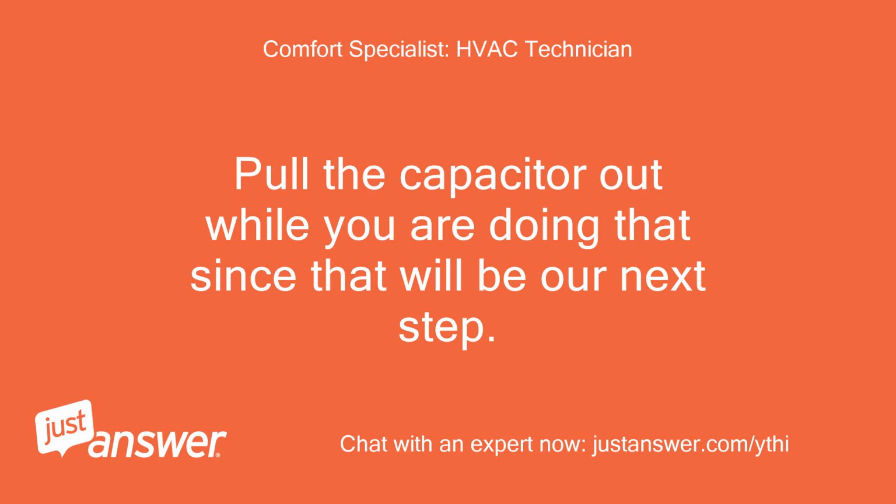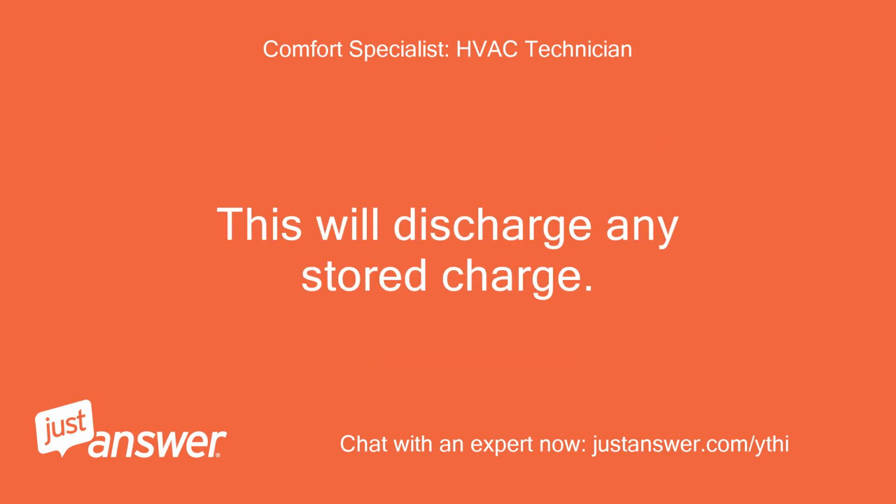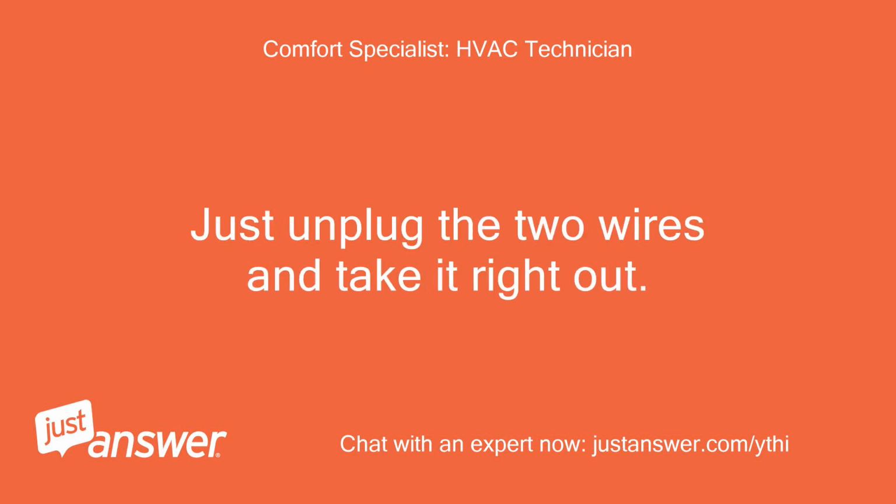Pull the capacitor out while you are doing that, since that will be our next step. Once you have power off, take the cap cover off and use an insulated screwdriver to bridge the two terminals. This will discharge any stored charge. Again, be 100% sure power is off. Just unplug the two wires and take it right out.